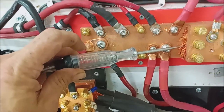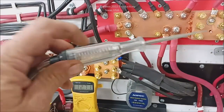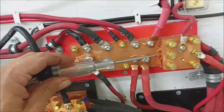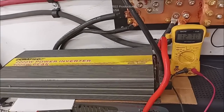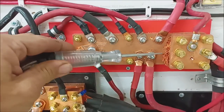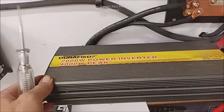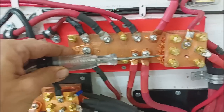It uses the resistance in that bulb to energize safely and slowly — like a big shock absorber, not a spring. Pay attention to that bulb. Now if I give this about two minutes it'll leak down enough — capacitors do that, they're not batteries. Give it a minute. Watch again — it just barely dimmed, it still had enough power stored. Watch: kick it on for just a second, then watch it again.